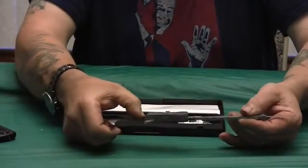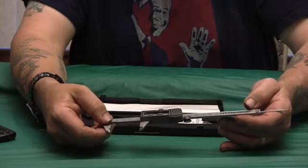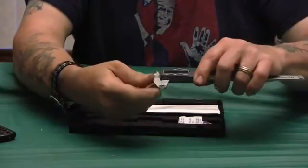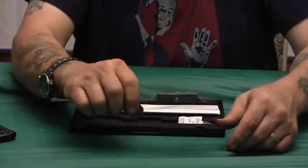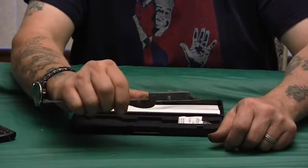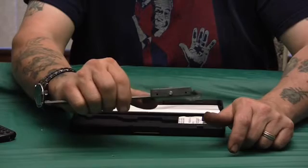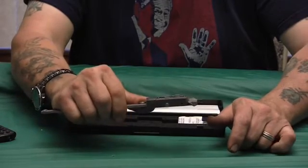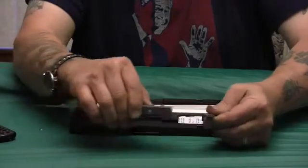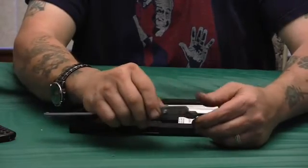A lot of people like the digitals because you can zero and switch from inch to metric and everything pretty easily. They're rough, they cost 10 bucks, they're not accurate. And what I did is I did a machinist accuracy test at work. A lot of people buy these, go and test with a feeler gauge and maybe something 1 inch or something. I've found that this thing will vary. The repeatability is 0.5 thousandths to 1 thousandth and a half. In any calipers, you take them all the way out to the 6-inch and then back, 6-inch back, 6-inch back, and that was going 1 thousandth, 0.5 thousandths.